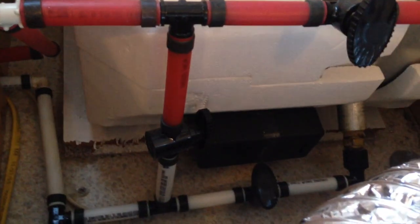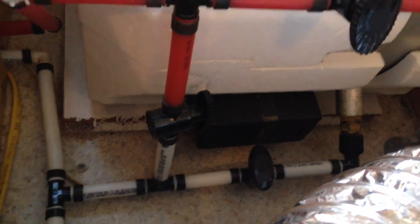But yeah, that is just a quick video on how to do your hot water bypass for your water heater inside your Tada, or your tab, I guess. I assume they're the same. I've not looked inside a tab, but yeah, so it's pretty simple. Water comes in, and you want to bypass your water heater using this 3-valve system here.